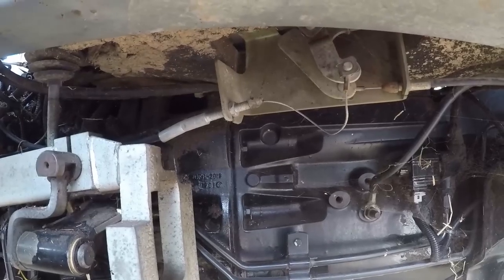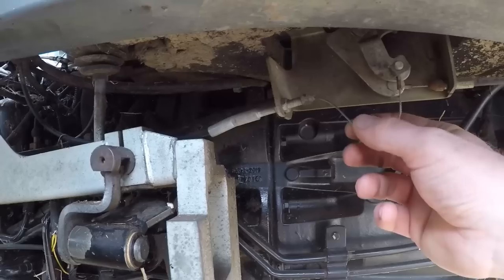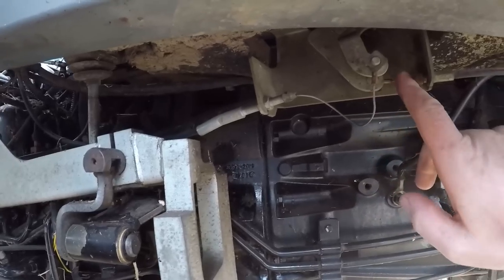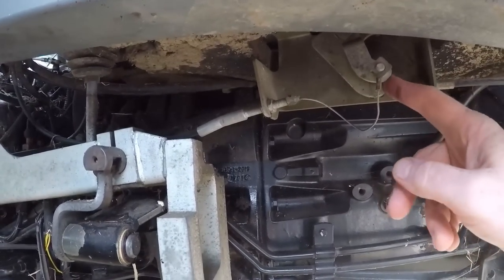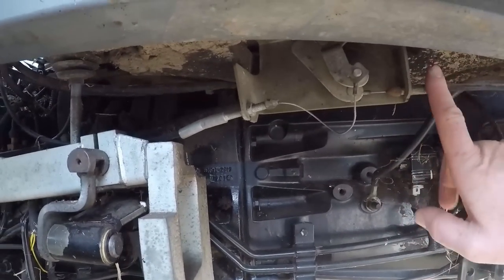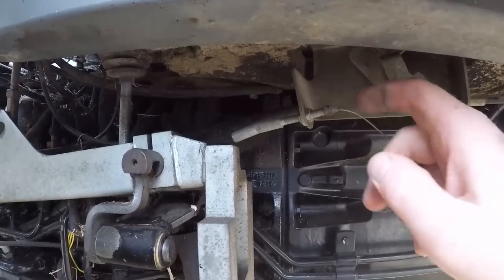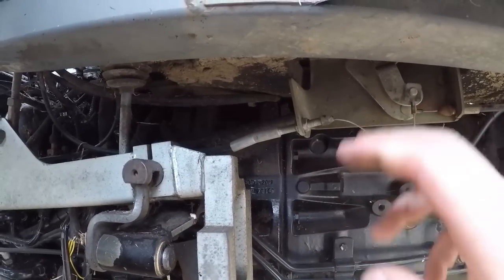And hopefully while we're there, we'll give the mixer a grease round as well, just because it'll be next to the workshop. Okay, so we're up underneath the cab now. So this is the cable coming down from up there somewhere, and you can clearly see we've got way too much slack. And then there's a second cable takes the movement on round to the fuel pump. We're going to change that somewhere, but we're not going to change it today. I have changed this one before, probably 11, 12 years ago. So this isn't original, but yeah, it has been done before.